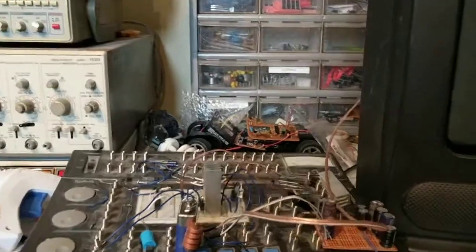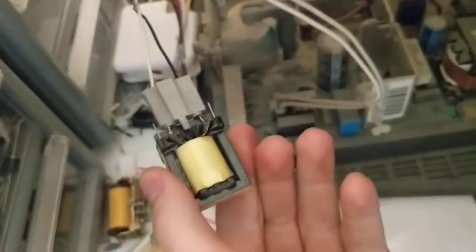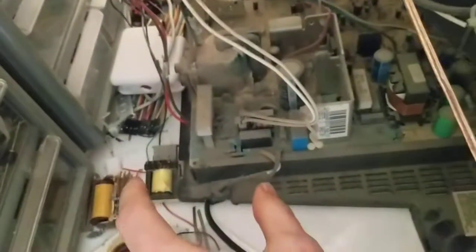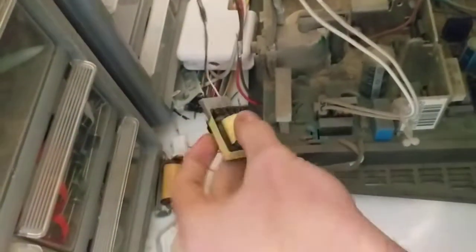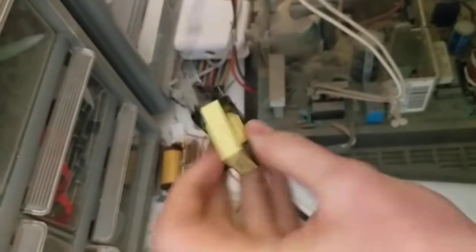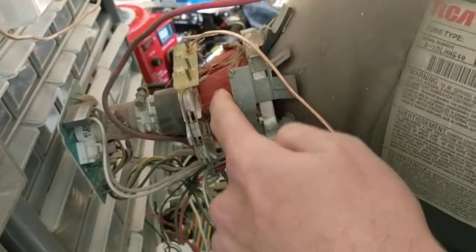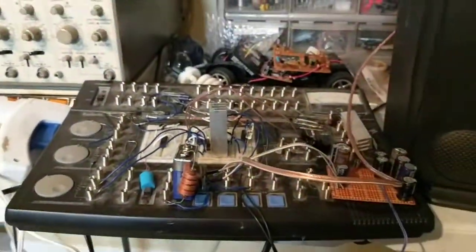But I do have a reason. If we go back here behind the TV, you can see I actually have the vertical coil plugged in because the TV will not turn the electron gun on unless it has something plugged in here. I tried putting just a resistor on here and it was like nope, not taking that. So I put this transformer on here because it has about the same resistance as the coil that was plugged into the back of the TV. So it accepted this, and now I've got a dot on the TV that I can manipulate with some other circuits like this one.